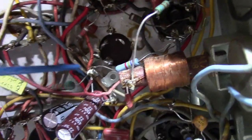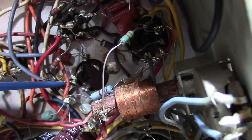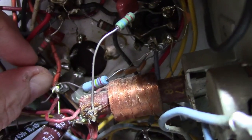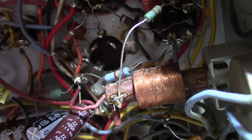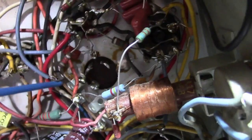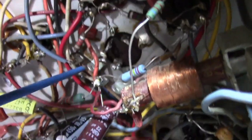Okay, I mean, that's a way to do it. But what I don't like is they attach this terminal strip by just putting a solder blob on one of the lugs on the old filter cap. It's not screwed down. So it's just tacked in on that one lug. I imagine if I flex this a bit, it would break off. But what I also thought was odd is there are no grounded lugs on this. Because of the terminal strip type they used, the two that could potentially be bolted to the chassis do not protrude upwards with grounding lugs.